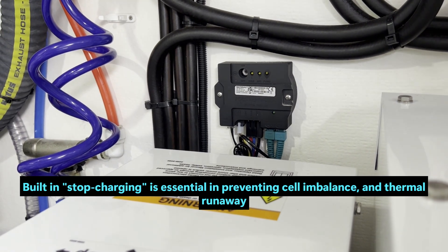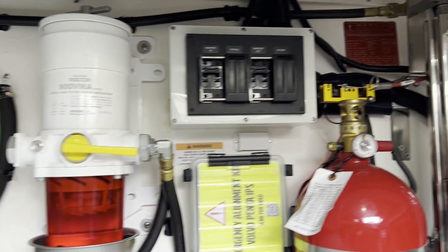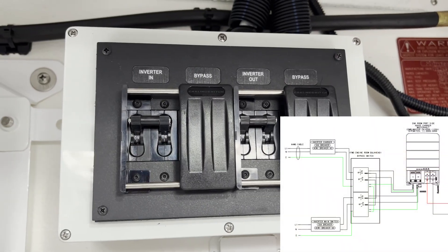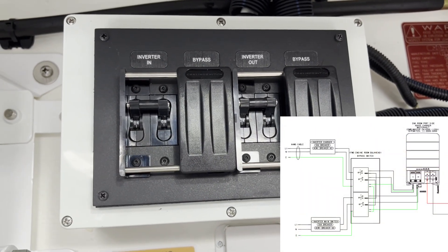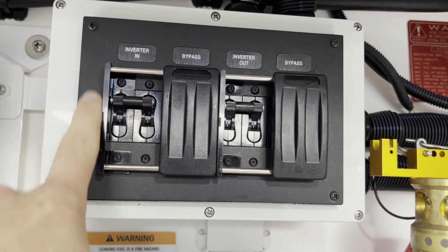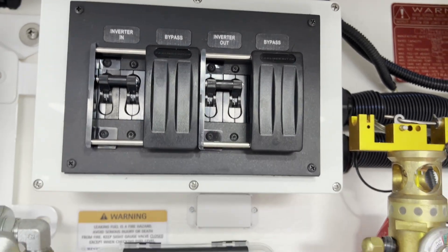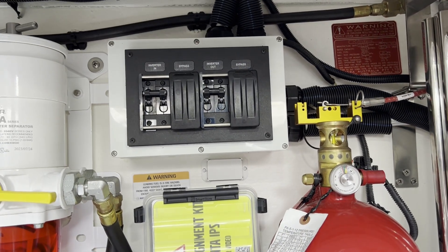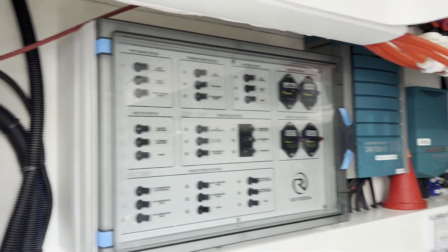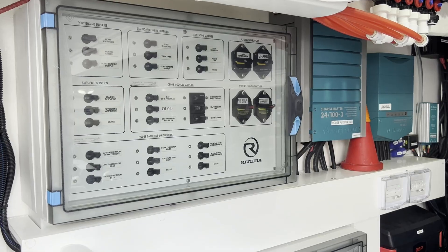We only work on integrated lithium systems where the batteries have that communication ability. We have this analog circuit-breaker-based inverter bypass box. So if the inverter fails but the generator is still functioning, the customer is not going to lose the inverted outlets, the Starlink, and all the devices that run off the inverter. All they have to do is shut off the inverter on the input side, slide over the bypass, turn that on, and same thing on the output side. This is a really nice feature when adding an inverter — that way you still get full functionality even if one device fails while you're offshore. That inverter is also a charger that charges up to 120 amps at 24 volts, so we get a lot of charging on that side plus the alternator.